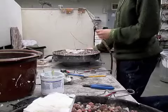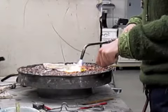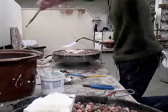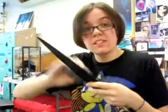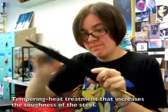I couldn't film the actual hardening and tempering of the blade, but I can still demonstrate what we did. After we added copper to the ends of the blade so that the solder would stick better, we heated it up until it was red hot, and then we quenched it — therefore hardening it. But instead of using water, we used oil. Before we temper the blade, we have to clean off all the burnt oil, accomplished with steel wool and a vinegar salt solution.